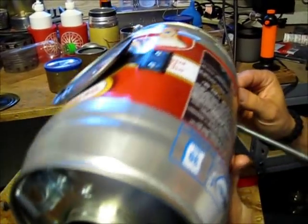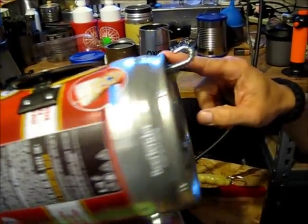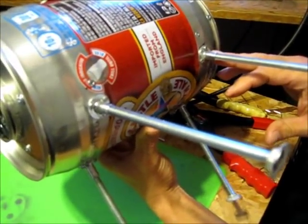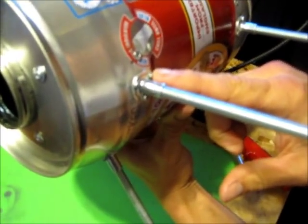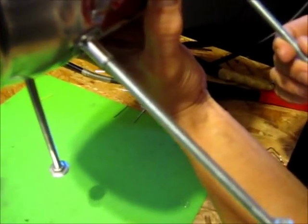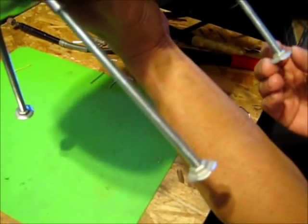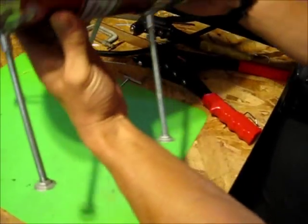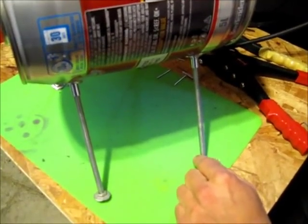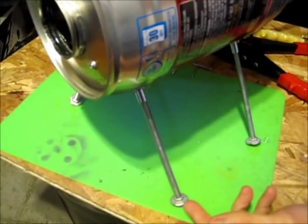I decided to use a safety lid to cut out the front of the mini keg, and immediately started putting in some rivets with some T-nuts and threaded rod, using steel rivets of course. I also decided to add small nuts to the base for a little more heat dispersion as well as traction, whether it's on the ground or on snow where you could get more venting underneath.